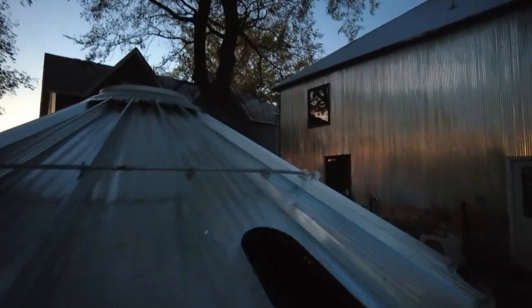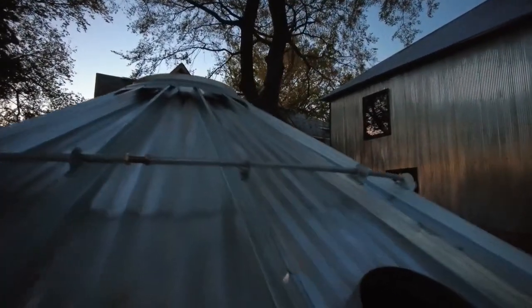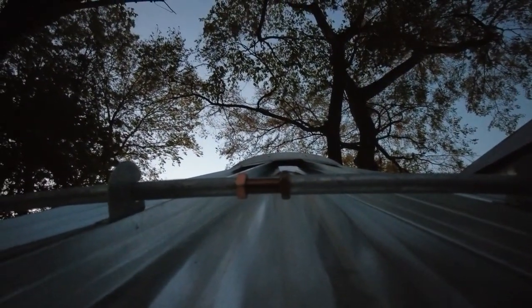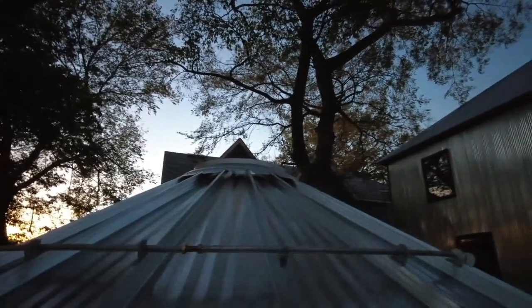We got all this railing done down here. I already talked to you about that, but we got the stiffener ring on, and basically it was pretty self-explanatory. You put those clamps on right there like that, and then run the bolt through there and tighten up the nut on the back side, and then you put those rings together, and then you have to cut that piece of pipe. We ended up cutting like 6 inches off. Put that bolt in there, tighten her down, and stiffens it up.